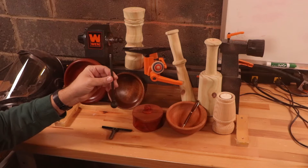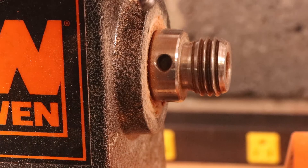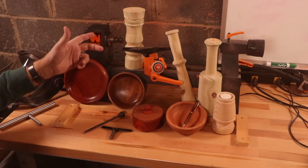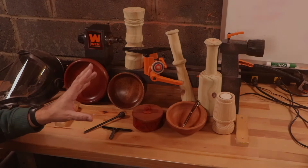The last issue is the ability to disconnect the chuck. The holes are already starting to get warped and I've already had to fix it a couple of times. I might have to get a new piece of steel, drill these out, or just flatten off two sides so I can get a wrench in here to tighten up the chuck. Flattening it off is probably the easiest thing to do.